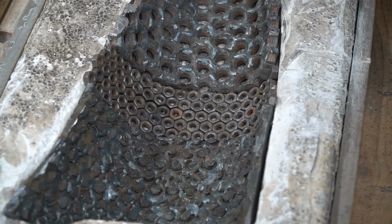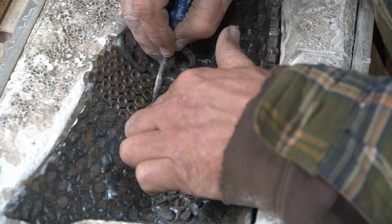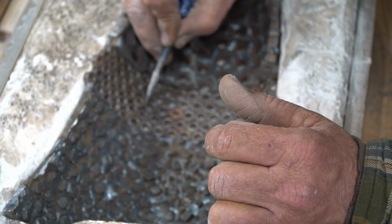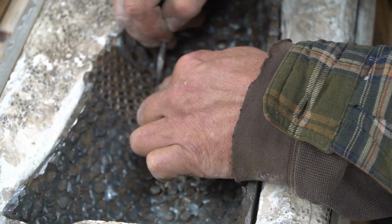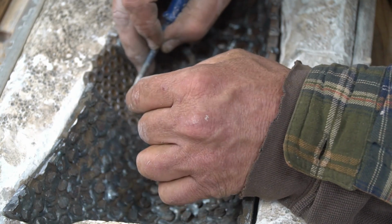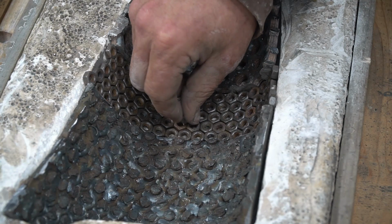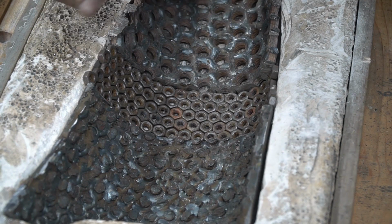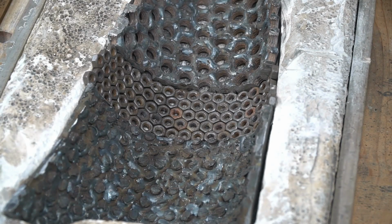What I'm attempting to do here is spread all these just a little bit, share the taking up the gap basically, just a little at a time. Anytime you're doing multiple dimensional things, just go a little at a time, and it won't be noticeable at all until you knock them off like that. I just shared the gap where I need it between them. By the time I weld it, by the time you're looking at it, you will never even notice what I just did.